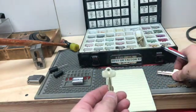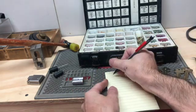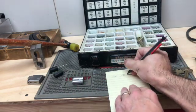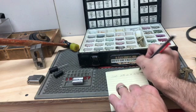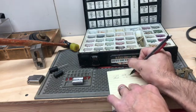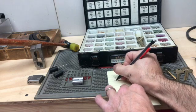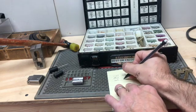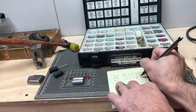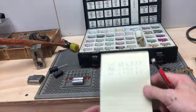I got C for control, M for master, and CH1 for change 1. So our control bitting is 2, 8, 6, 7, 3, 5. The master is 5, 3, 8, 2, 6, 1. And then our change 1 is 7, 5, 4, 4, 8, 5 — something that you might see in an actual, for real master system. So those are the bittings.